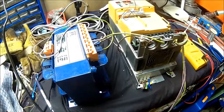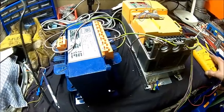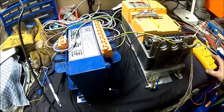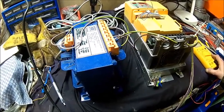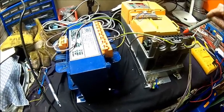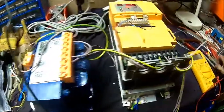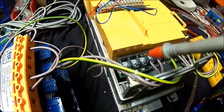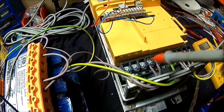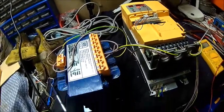Any questions, let me know. Please don't do this at home — it's dangerous. If you don't know what you're doing, ask someone who does. Even on the output, if you think nothing is on, there's still voltage there. Also, many inverters including this one have a DC bus of about 720 volts DC which can pretty much instantly kill you, so be very careful.